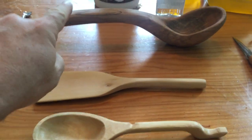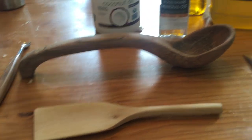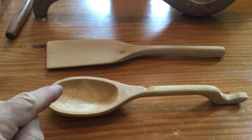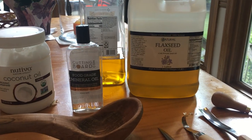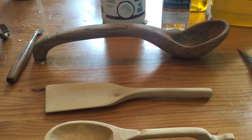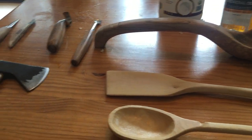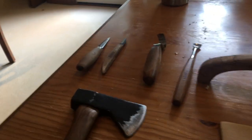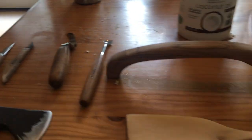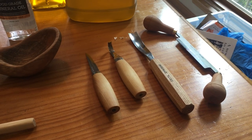What I would say to you is: don't carve dry wood, and I'd encourage you not to use mineral oil — even food grade mineral oil — on your product. Use flaxseed oil or walnut oil. You have to keep oiling with mineral oil to keep it protected. And the other thing: have good sharp tools. These new tools versus the old ones — it was night and day, absolutely incredible.